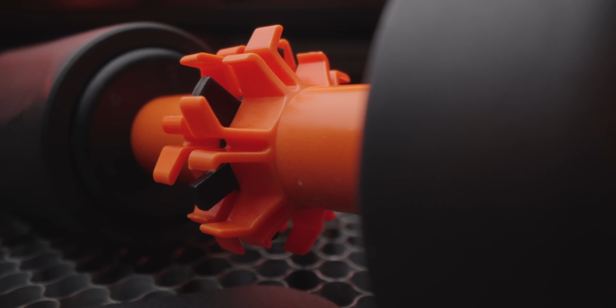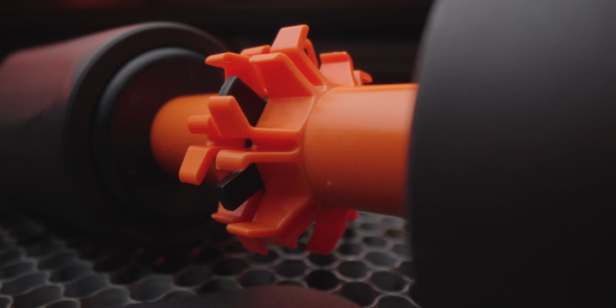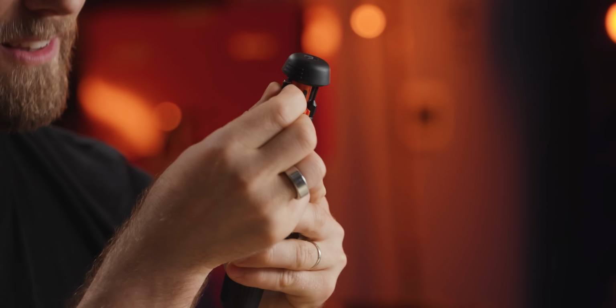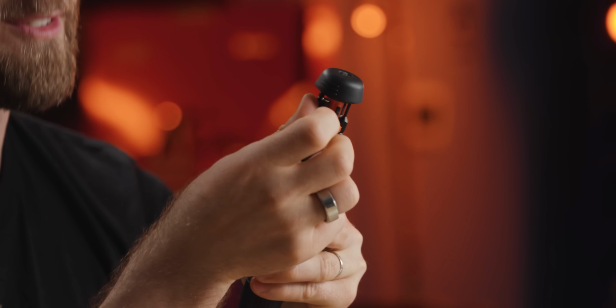The internal plastics are also mostly Triax 1120, but the bit clips and the little ninja star that's in between them, as we like to call it, are made out of Delrin for its excellent wear characteristics. The last thing you want is for these little holders to just start snapping off on you.